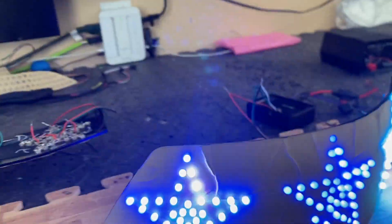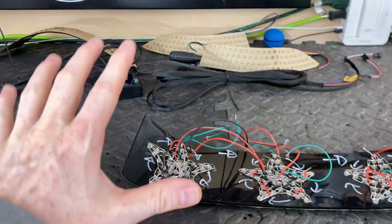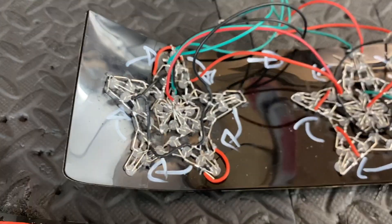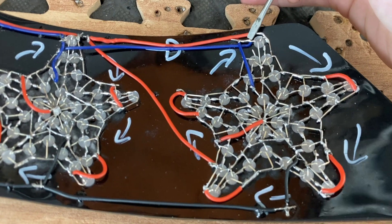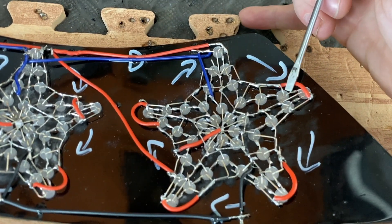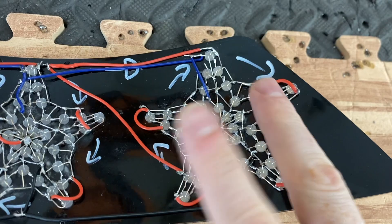Speaking of the star pattern — this is a part of the design the customer wanted. This board is the first one we worked with, and this star is the very first one I made. It looks like a complete unorganized mess, which is why we referenced this paper I've been staring at for days. Blue is data — data in and then data out going to the other LED, data in then data out, all the way around the outside and around the inside as well. That takes care of two of the four pins.